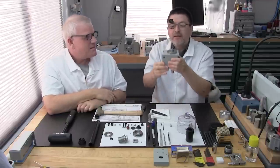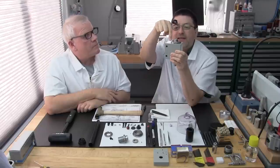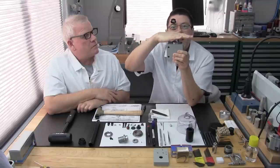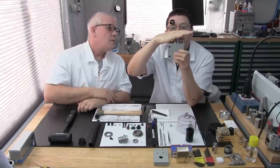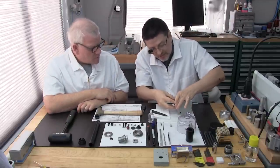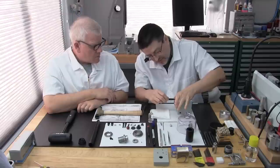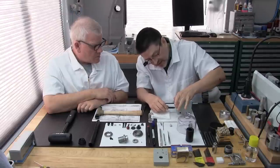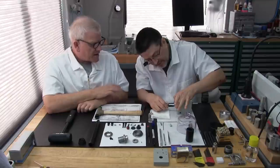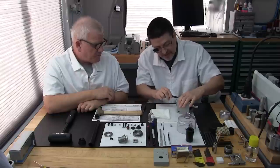The other thing I want to point out is, when you tighten the first screw, you've got to be really careful, because if I just tighten one screw really tight, it can cause this bearing cap to cock, like that. So what I do is hold it against the bearings really tight, and then very lightly, I go to the top one, just very light pressure all around, and I start the star pattern. That gets it level on there, see? I do it about 3 times. Just take your time.